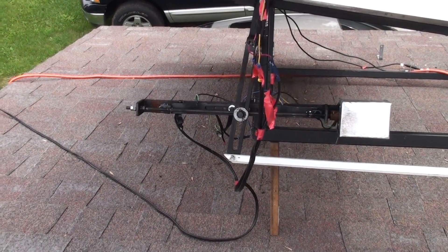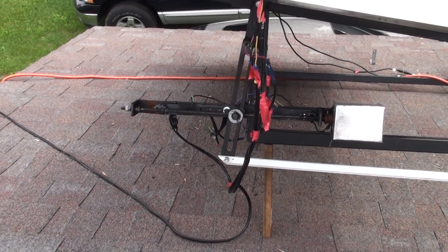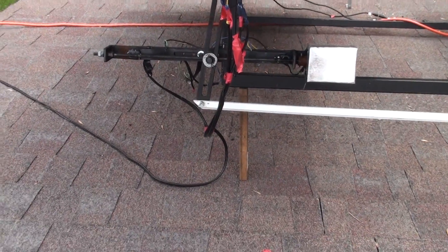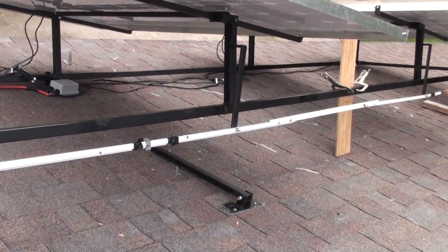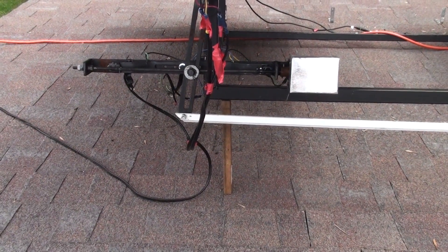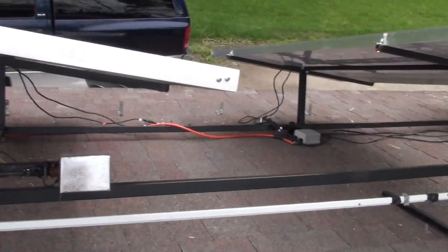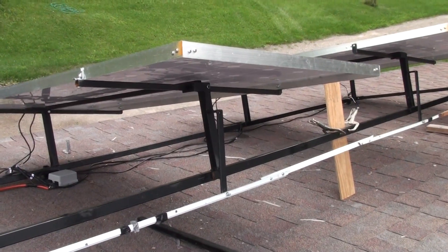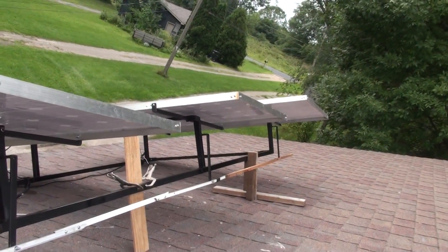I'll have a motor like this one with a threaded rod between some square tubing set up like a scissors deal, where it'll pull together and push apart to raise the elevation. I also need to brace it — the one-inch, two-inch-and-a-quarter tubing I have here isn't as strong as I thought it would be, so I'm going to have to build a little more bracing underneath to make it sturdier. The bottom doesn't matter because I've got a leg at the bottom of each panel anyway.